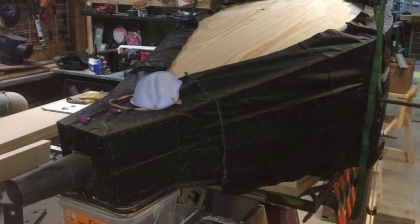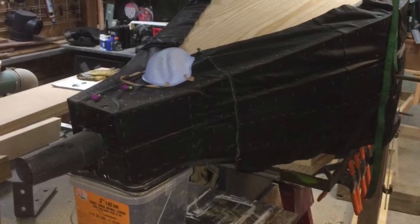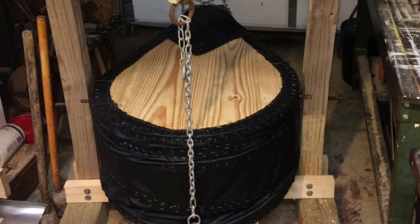I then turned my attention to creating the metal tube for fitting of the pipe to the tuyere. A hole was cut in either side of the leather on the bellows to facilitate a piece of iron rod going across the undersection of the middle set of 2x boards to facilitate actuation of the bellows.